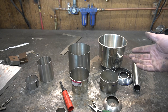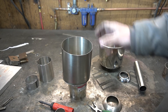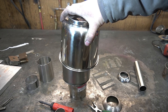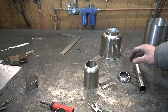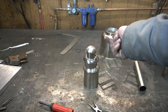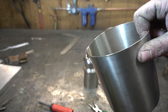I think I've figured out how this thing's gonna work. The outer body is gonna go: cup, piece of a bowl, sugar pot, and then I'm gonna cut this little bowl up and use it as a jacket for the outside to water-cool it. And on the inside we go: cup, rim of a cocktail shaker, inside of a thermos, measuring cup, piece of a lamp, lid of the cocktail shaker. This will create our three stages of oil vapor jets shooting downwards. Nothing to do but to painstakingly try to TIG weld this very thin stainless.